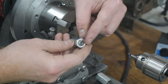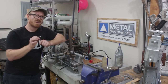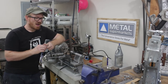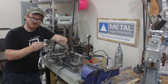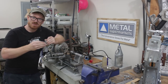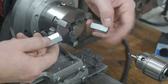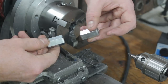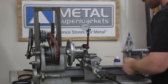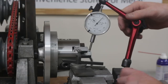The idea there is that because I don't have the ability to cut threads on the lathe, and I don't have the right tap to thread a smooth rod with the right threading, I will have to use these coupling nuts to connect the threaded lead screw to the turned ends that will extend through the supports for the lead screw. To turn those pieces from threaded rod, I need to have centers on each end, and this seemed to me the best way to go about getting an accurate center. I use a three-jaw chuck to hold the coupling nut, then I indicate it to make sure it's well-centered.